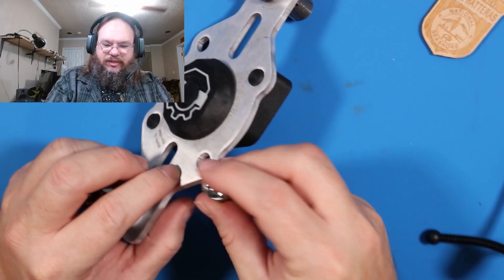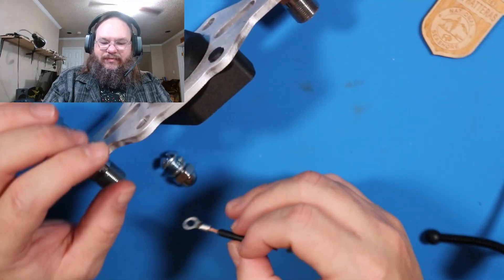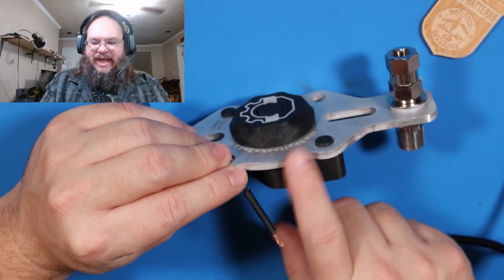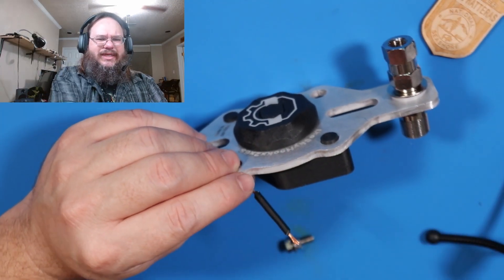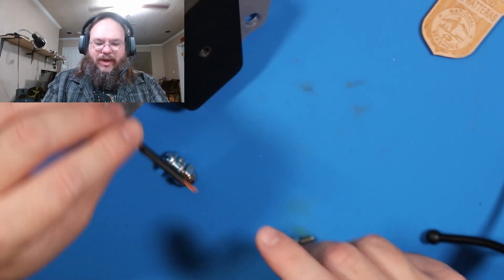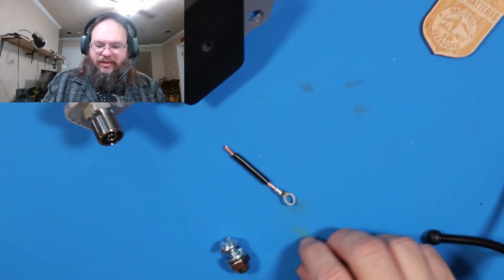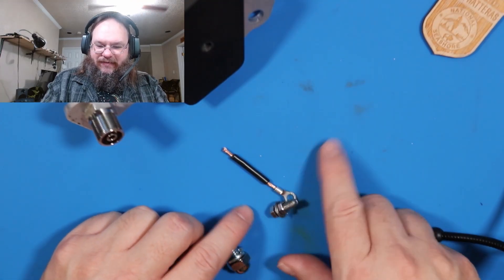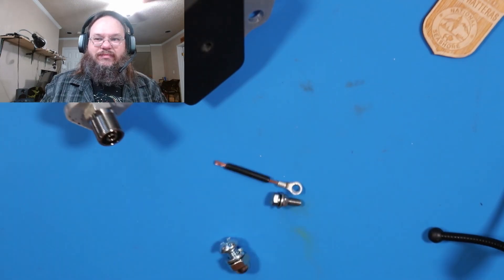Let's head over to the bench. I'm going to mock this up for you. We got the hamstick here and then we got some nuts and bolts — it's going to connect to the opening there. I'm going to use a ring terminal to connect there and put a simple plug so I can disconnect and reconnect a longer cable that's going to drop all the way to the ground. From here we're probably going to use a power pole, connect to a longer wire, and then have another short end extension on the bottom to another bolt, and that's going to have four ring terminals coming out of it — those are our counterpoises, which will sit on the ground.